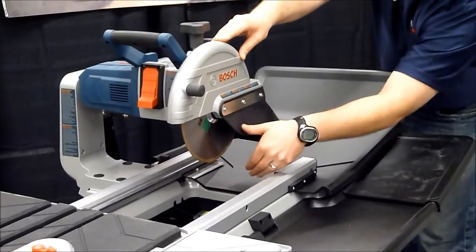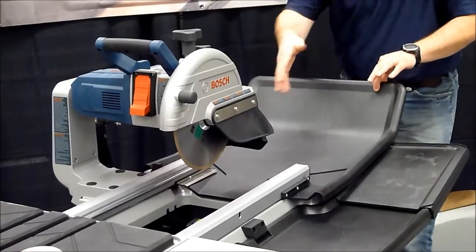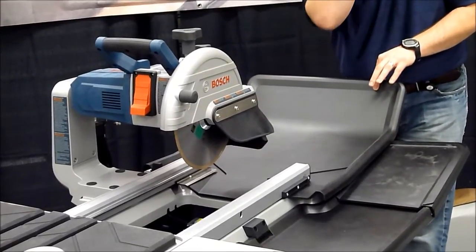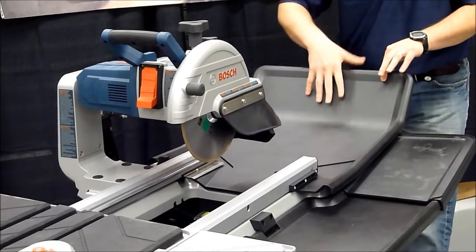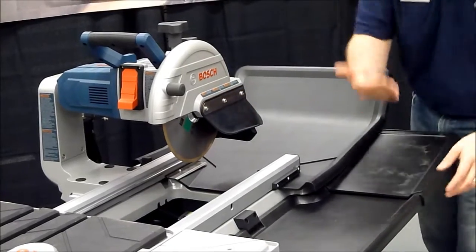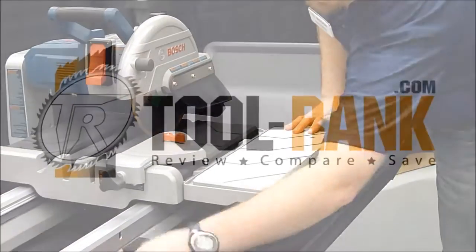The rear actually starts at the blade point — we have a hood around the back, so it keeps a lot of the major parts that drip down in as the water comes out. Plus we have the rear tray, so as that kerf is created in the tile and it wants to kick water out the back, especially at the end of the cut, it collects off the back and flows back into the main tub. Same thing on the side — as you're passing the tile through and water drips out, it drips onto the tray and goes right back in on this side.